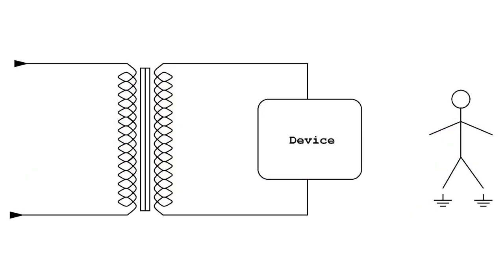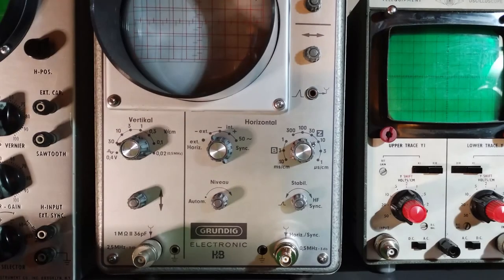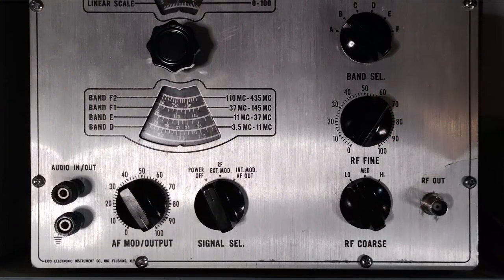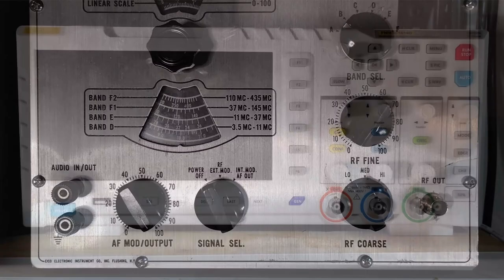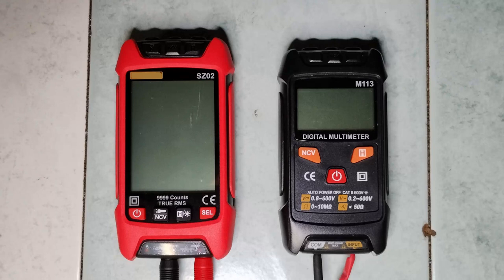Therefore, one should choose their own safety policy, considering the risks that every choice implies, but also considering the regulations and the responsibilities in not respecting them. In my personal practice, I prefer to connect to the external electrical ground all the pieces of equipment that have a metal cabinet, even if they were designed and built in the 1950s or before, originally without a ground connection. But, of course, it is much safer using equipment that was designed for being fully isolated, especially if it is powered from batteries.